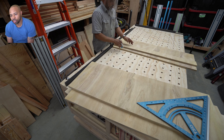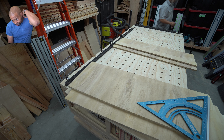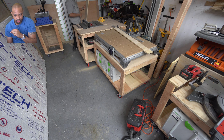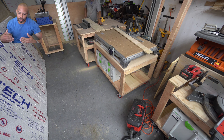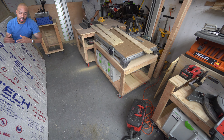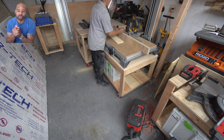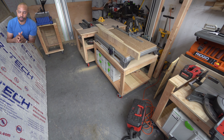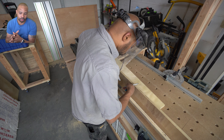Now I'm marking out the locations creating this story stick. As I'm doing it, I'm going to realize I'll need at least four story sticks — I'd want them on both sides to support both sides of the cut, and I also needed two different lengths: the longer dado and the shorter one, because there are basically two dados going across these sheets of plywood.